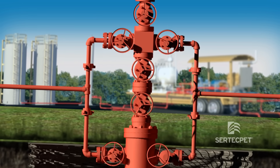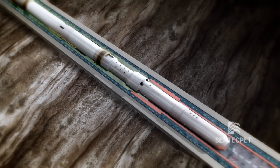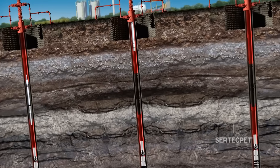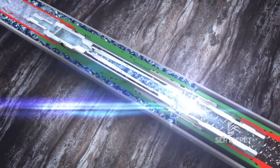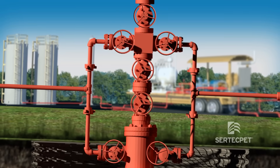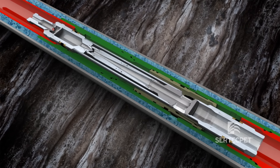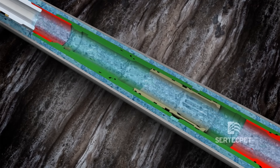The smart direct jet pump is hydraulically recovered and information is downloaded when the pump is on the surface. The direct jet pump is used in permanent production and testing of exploration and development wells; its recovery requires reversing the direction of the power fluid, injecting through the annular space so the equipment is pushed up through the production tubing.